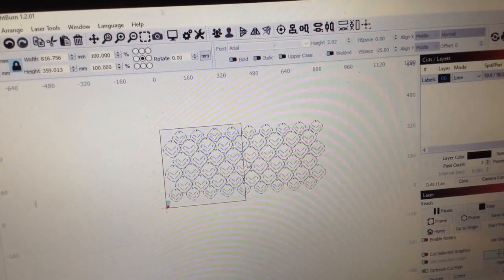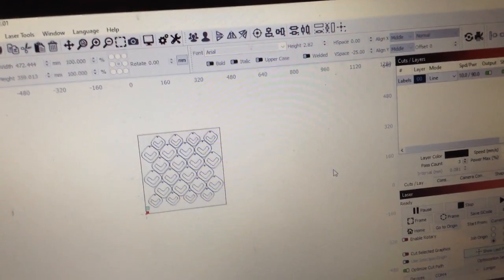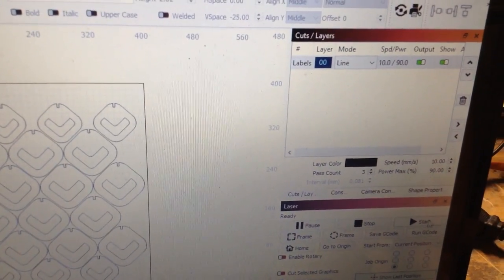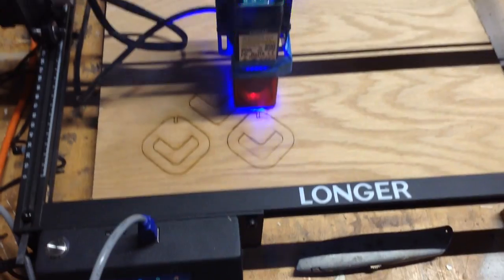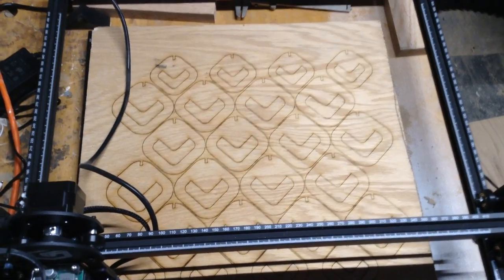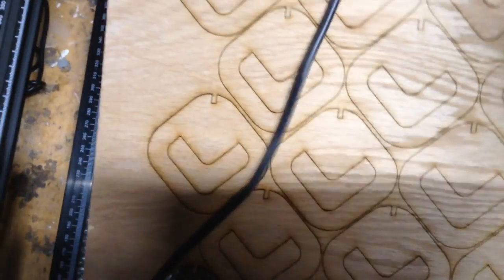I can save as a new file so I don't overwrite the original, and the window preview tells me how long it's going to take. My speed was at 10, power at 90, and I think it was three passes, changed to four at some point to get through the red oak. I had this laser going for multiple days — I had to cut out 76 large triangles and 18 small ones, plus all the harp and armature pieces. It never overheated or anything like that. The back side cut through nicely and I could pop all these out and start creating a stack of pieces.